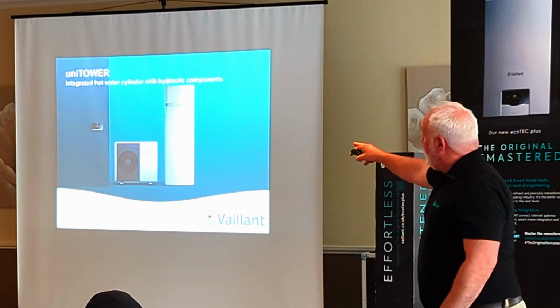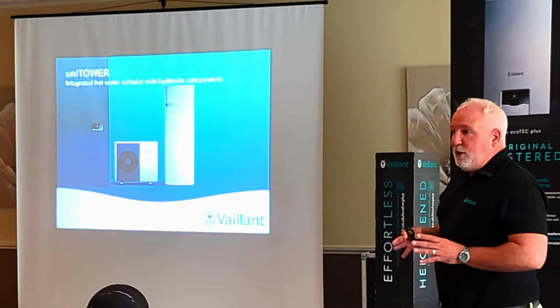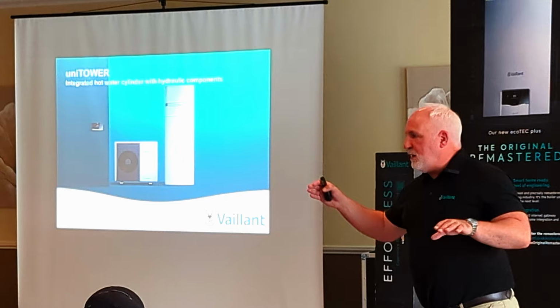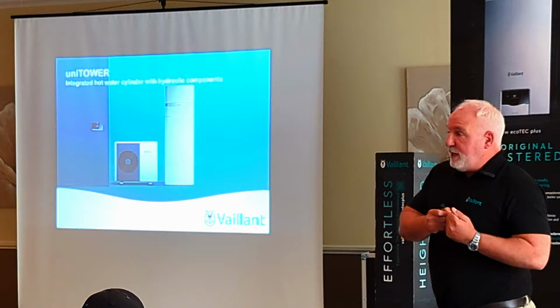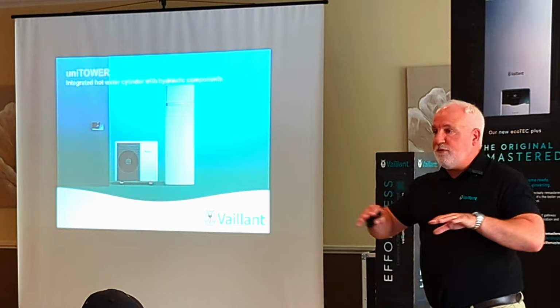But you've pretty much got everything there, plus your sensoCOMFORT that Simon mentioned earlier. It's the same controls. The main difference with a heat pump is you wouldn't have your on-offs and offs. You'd leave it on all the time. And that's one of the things that people struggle to change over to, going from gas, which is my background really, going from gas to heat pumps, is that you don't really time them to go on and off. Just leave them on, with thermostat control and temperature.